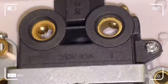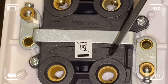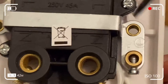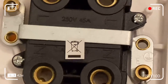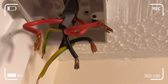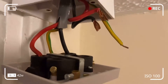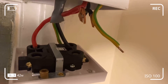The non-defective pull cord switch is what we're replacing the defective one with. The live and neutral from the supply should not be mixed up with the load or appliance side — and here you can see where the earth wires go. The wires are quite thick, which is why we need room when fitting in the new pull cord switch. I've differentiated the supply side wires, fitted them into the screw slots, and subsequently I'm going to fit the ones that go to the load or appliance.